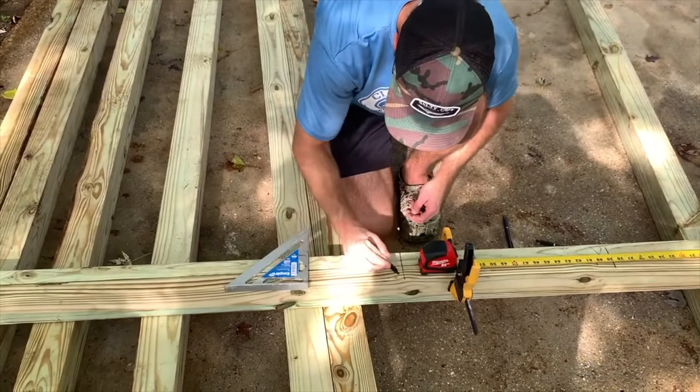I used 1.5-inch exterior rated screws to secure this instead of nails. Since we're working against gravity, I figured the extra additional security of screws was worth it. And here I am cutting the smaller soffit strips for the side of the shed. And then we're gonna go ahead to the side of the shed and install that piece of soffit.